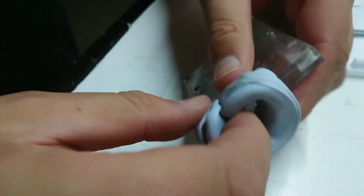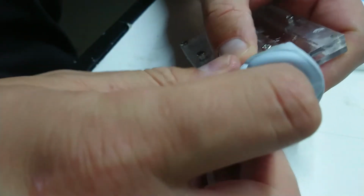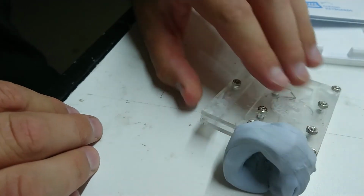And I know this is a little hard to film me doing this if I want good results. But we'll get a little bit of a funnel happening like that. And then we'll make sort of a second one around the other side. And that should make it a little easier to pour. And we won't have it flowing down the outside of the mould this time. Right, so I'll make another one of them and we'll be right back.